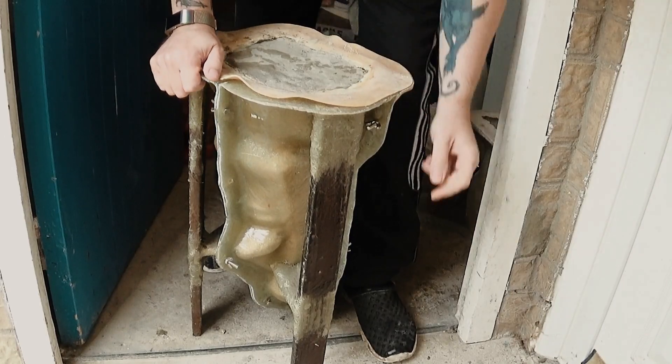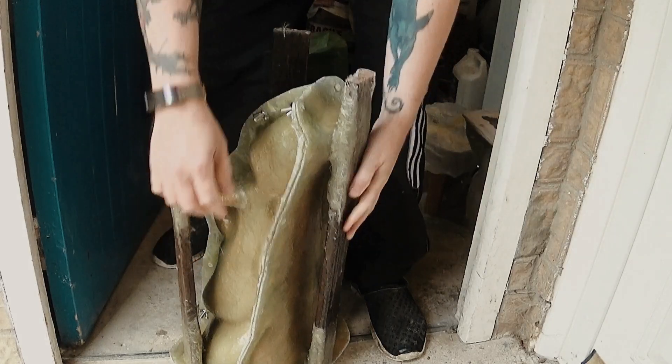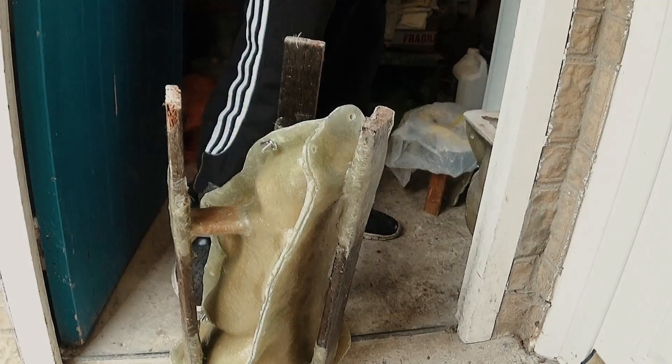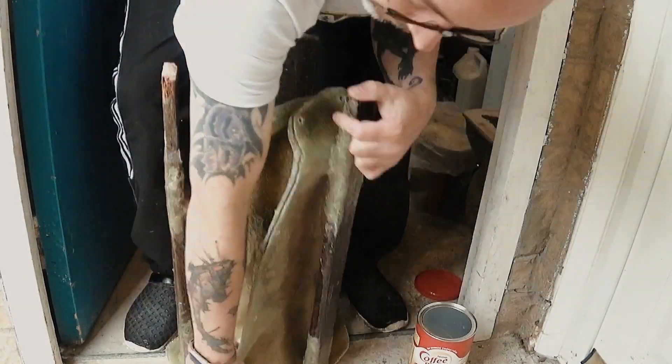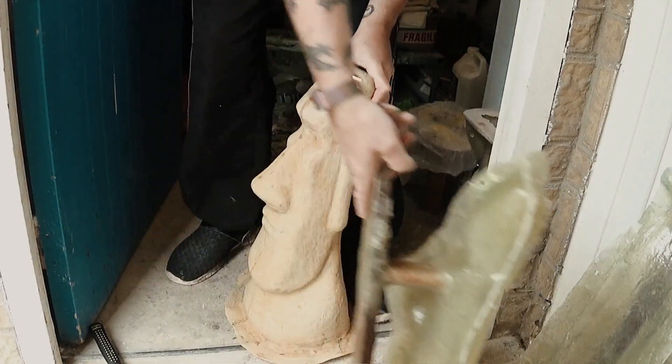But what I was going to say, like I mentioned in the first video, was that I was a bit concerned that I'd mixed the concrete a little bit too dry, which was the case. So if you get any sort of problems with bigger bug holes, it's probably down to your concrete mix being a bit dry or a bit too thick.